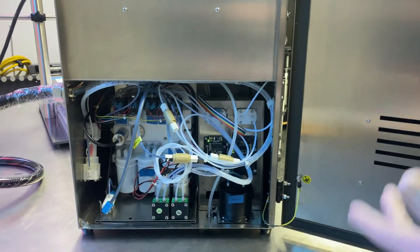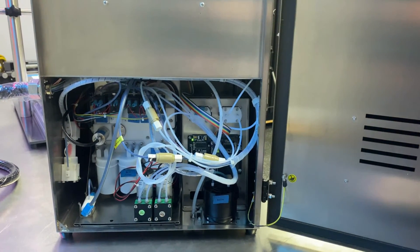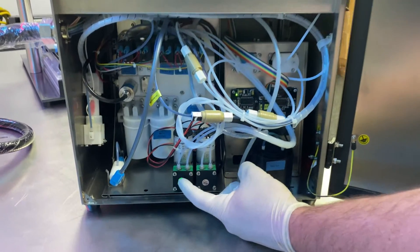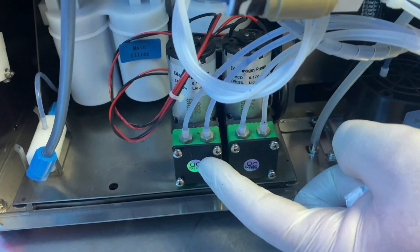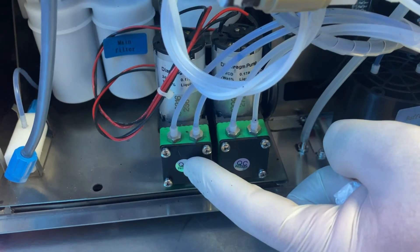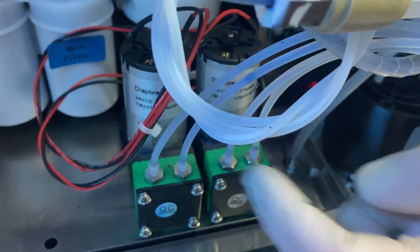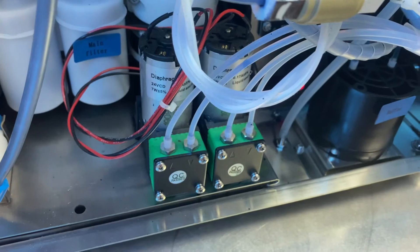While the system is adding makeup to the mix tank, you can go to the back of the machine for a visual check. Look at the pair of diaphragm pumps: the pump on the left is the ink transfer pump — normally what fills the mix tank with ink. Now that we've put a makeup cartridge in the ink slot, the ink pipes on that diaphragm pump are already clean, confirming makeup is flowing from the cartridge through the pump and into the mix tank.